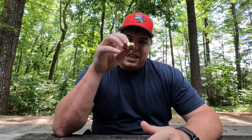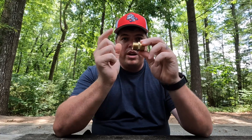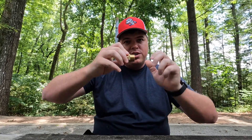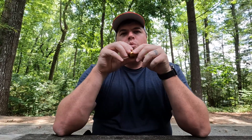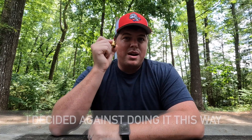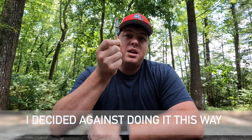Next, we've got our connection fittings. These are three-quarter-inch NPT to three-quarter-inch NPT, both male, so you can screw your filter housings together. Last, we've got our three-quarter-inch NPT to half-inch PEX fittings. This is where I'm going to directly splice into my RV's plumbing system so that my filter is permanently mounted.